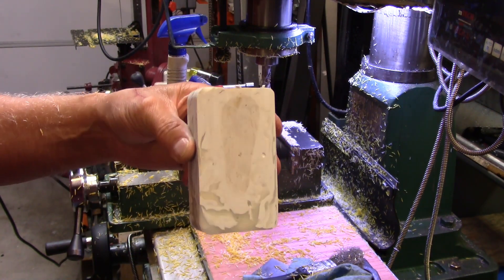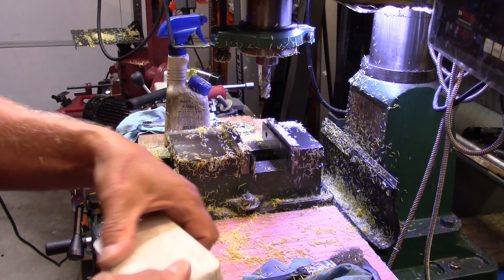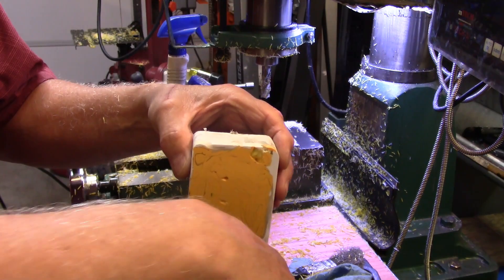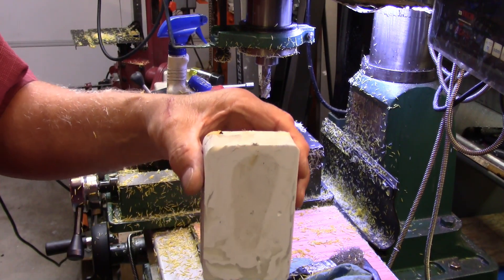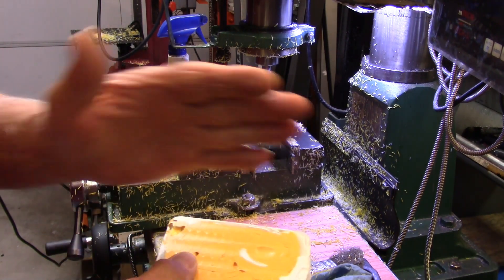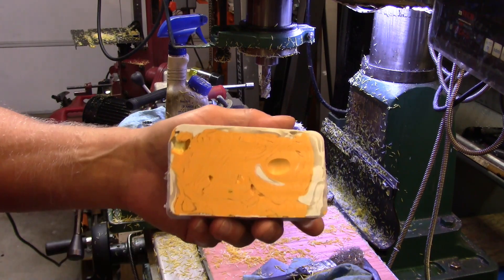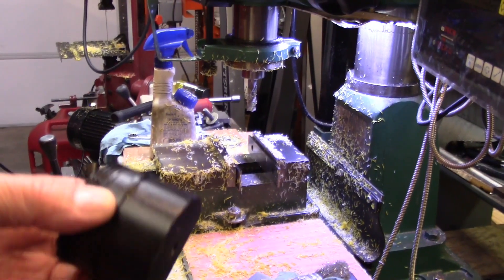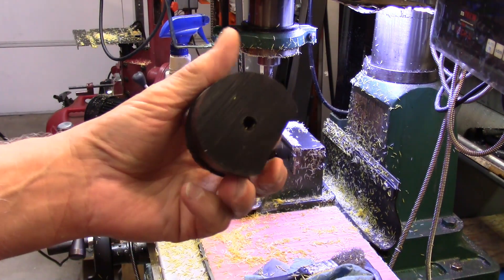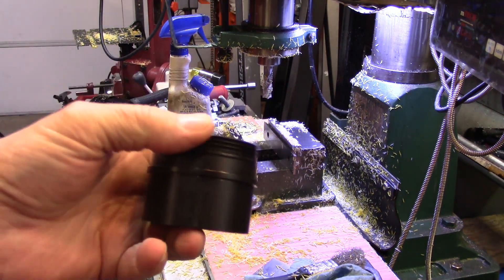It came out really good other than these voids here and there. I guess I rushed the job a little bit and didn't let it stay in the oven long enough to get all the air bubbles out. This next piece I'm going to apply more heat for longer. When I get it, we'll sandwich them together — drill a hole here, a hole here, maybe a hole over here with them touching each other — and they'll be vise jaws. Special ones, made to hold an AR-15 barrel, any other kind of rifle barrel, a pistol, long pistol barrel — whatever — in between the jaws. One of the guys from my shooting club named Brian gave me a bunch of cut-offs. I think these are Delrin. I cut it off with a saw, playing with it, seeing how hard it was to work with — it's pretty neat. Thanks, Brian.